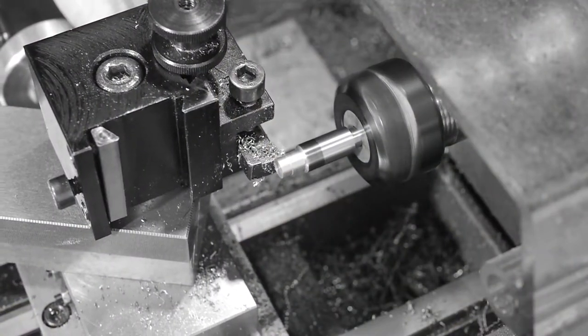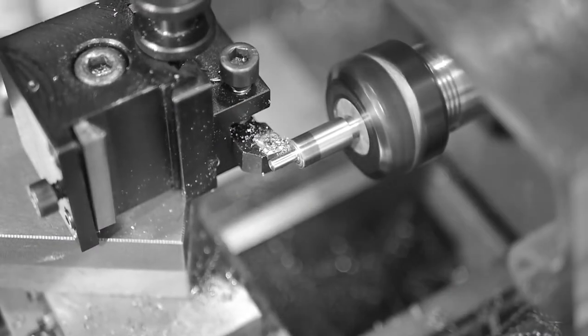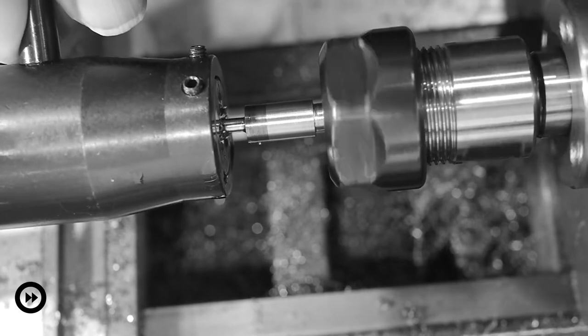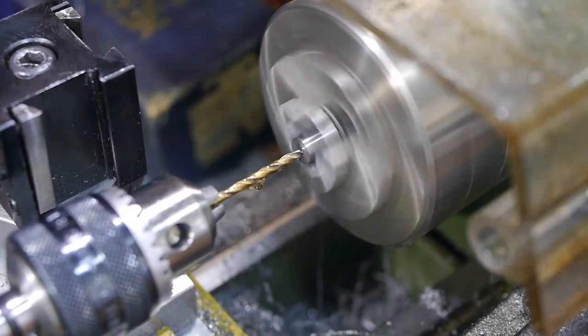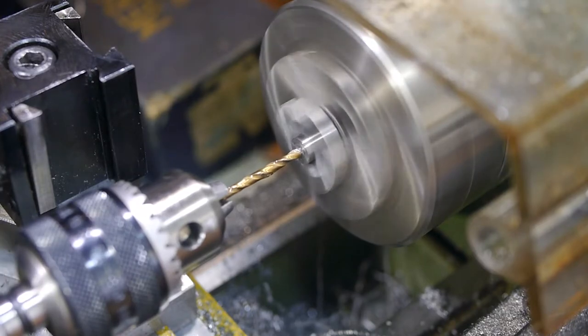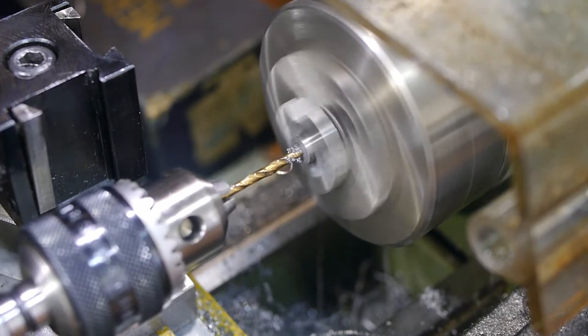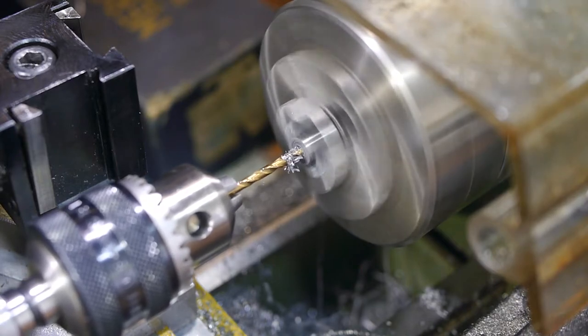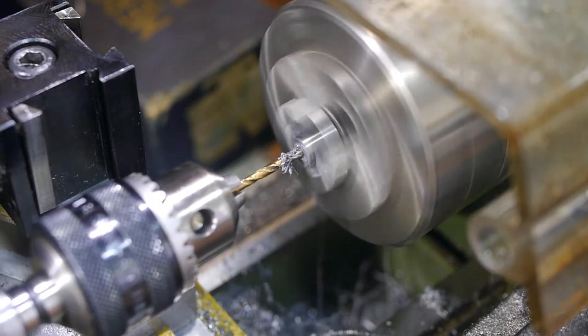For the second shaft with a thumb screw, I didn't record cutting the threaded portion or the knurl, as the procedure was the same as last time. Here are some snippets from episode 10 of that part being made. A critical problem I mentioned earlier was that this thread must be coaxial with the smooth portion of the shaft on the other side of the wheel. I attempted to ensure this by turning all of the features without rechucking, but the part was too flexible to handle the plunge cuts and was bent beyond reasonable repair.